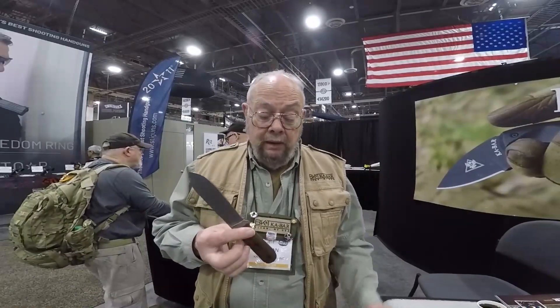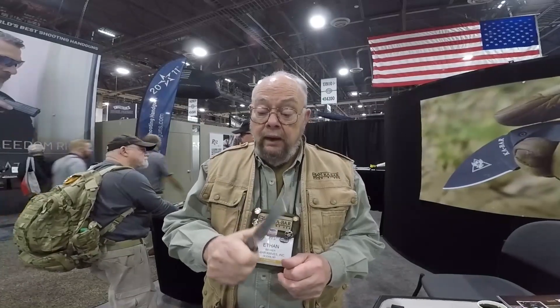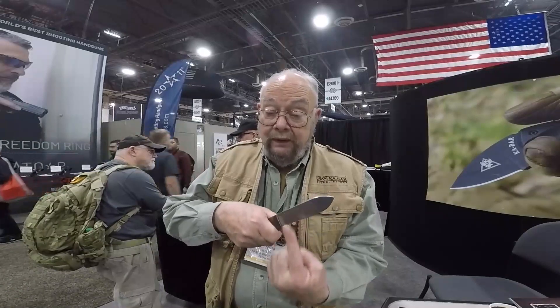The great thing about this blade is it's very simple. We've made it out of 1095 carbon steel, which is very similar in chemistry to what used to be called double shear steel, which is what they originally used. It's fairly thin, but because it's fairly tall, you end up with a blade that fills the hand properly and orients the edge. You always know where the edge is because it's right up and down. Too round a handle and you never know where the edge is.